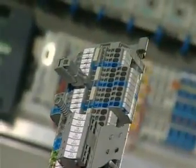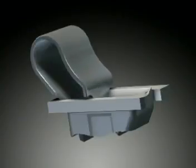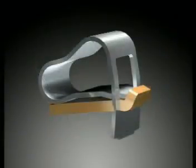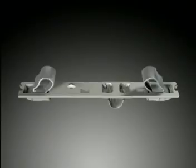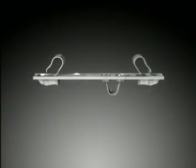The core of the Topjob S rail-mounted terminal block is Cage Clamp S. Cage Clamp S is a completely new design approach. It is based on the Wago cage clamp, which has been used all over the world more than 7 billion times. The integrated cage in the current bar not only guides and surrounds the conductor, it also supports the spring clamping mechanism. An idea of genius which makes Topjob S the most innovative range of rail-mounted terminal blocks on the market.